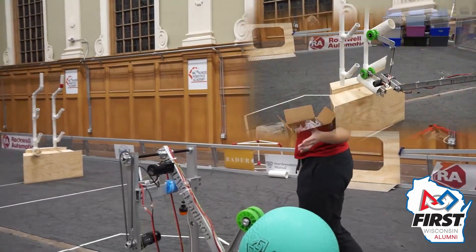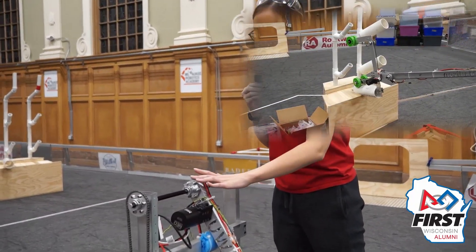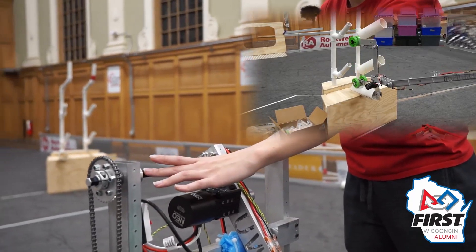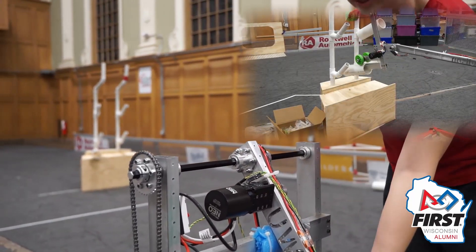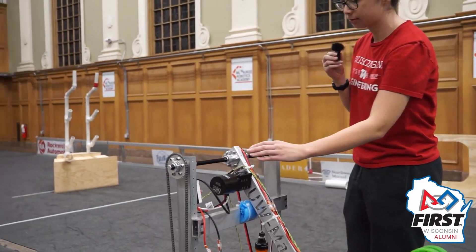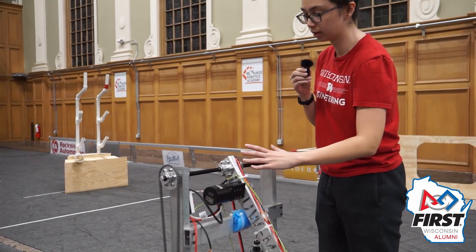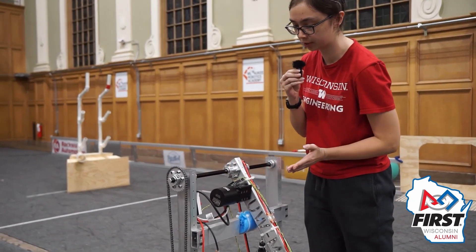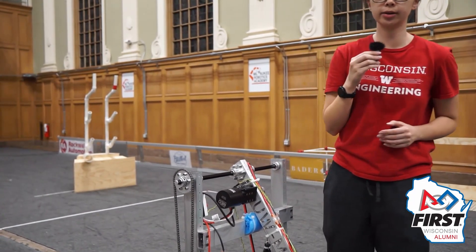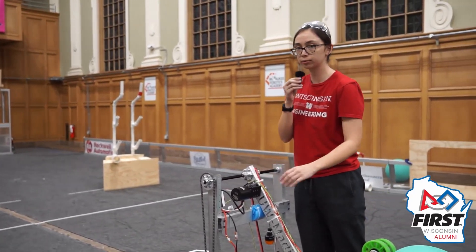Finally, if your team wants to go along the route of using an arm, having this really long shaft is not ideal. This long shaft allows for a lot of deformation and wiggle in the arm position. If you can shorten up the shaft so that maybe you have a triangle coming in here instead of having this really long shaft reaching between two very distant bars, that would be really great and provides more stability as well as reducing the amount of wiggle room that your arm has.